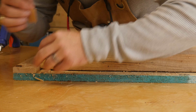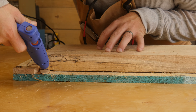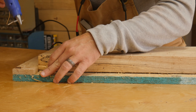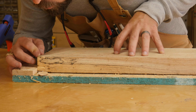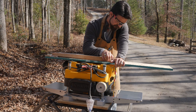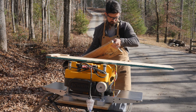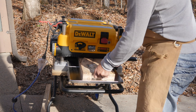Because these boards are pretty warped, I went ahead and used my planer sled to give them a good reference surface to make them really nice and flat. I shimmed them up to where they didn't rock anymore on this makeshift sled made out of OSB and then ran them through my planer. Once I got a good flat side on these pieces of pecan, I took them off the planing jig, laid them on the flat side, and planed the other side down smooth.